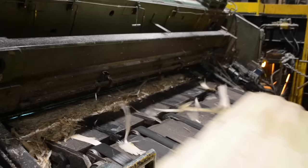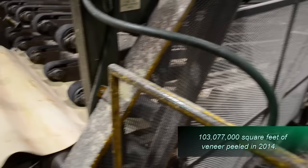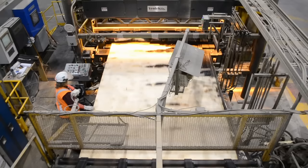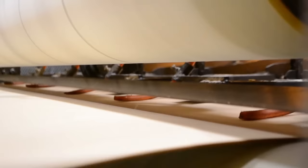There are three trays that carry the ribbons down to the clipper; each tray can handle up to a 15-inch log. The ribbons empty onto the clipper table where they are cut into 4x8 sheets. The clipper system also cuts out defects and reads moisture content for stacking purposes.